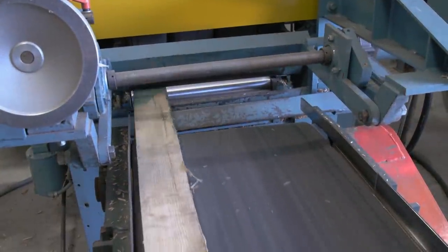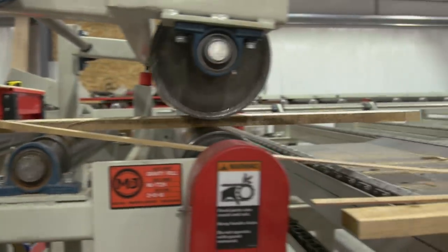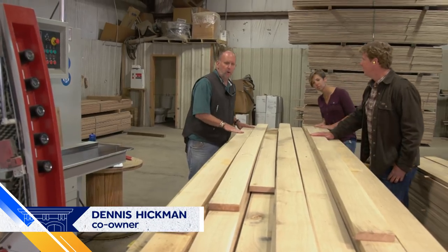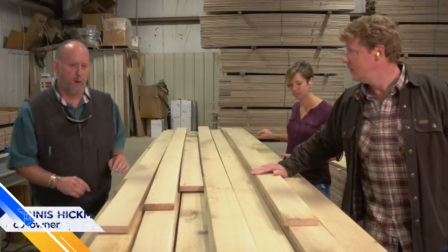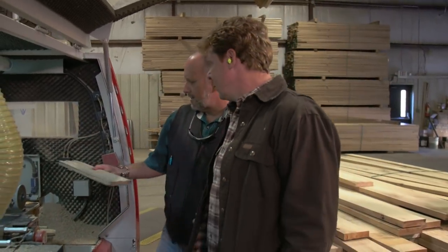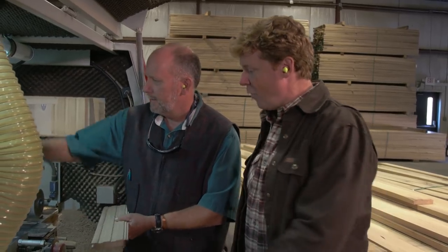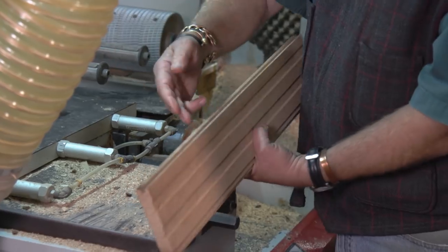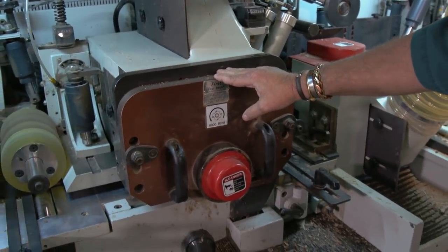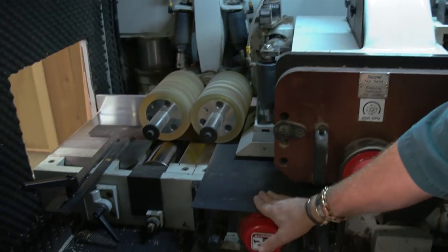Now dried, our rough sawn lumber begins to be dressed out to flooring — it gets scanned, sorted, planed, and trued before heading off to finer milling. Jessica and I meet up with her dad, who'll take us through the milling process. What we have here is rift and quartered white oak — surfaced to 15/16ths, ripped to 4 and a half inches wide — ready to come into the molder. This molder is a six-head machine. Jack is picking which face comes through upside down. First head is just a hogging head, takes a little bit of wood off the face side. Second head puts the groove. Third head puts the tongue. Fourth head is just a hogging head taking some off the bottom side. The fifth head puts the relief cut on it, and then the last head is just a finished head on the face.